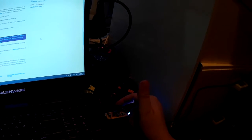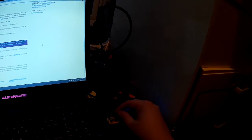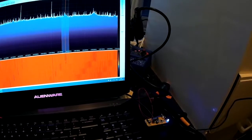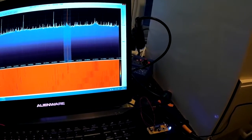But it depends on the location I am in this room as well. The other side of the room, I actually get a lot more FM breakthrough. I mean, I've heard of AM breakthrough, which is where AM stations get into ham radio equipment and stuff at those lower frequencies. But it seems there's a lot of FM interference as well. And it really is across the entire range. I picked up something at like 2 megahertz, 3 megahertz, 4 megahertz, 5, going all the way up and just kept going past and beyond up to 1.4 gigahertz or whatever it was in the software menu. I think it was like 1.4. I don't know if I'll pick it up now. Let's turn it on. I'm in wideband mode.